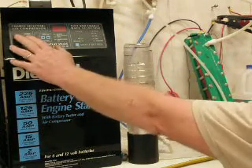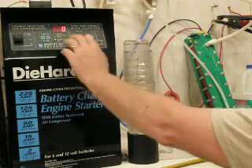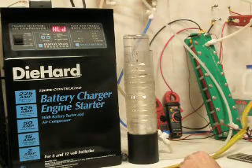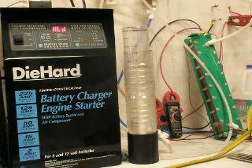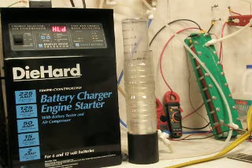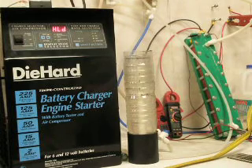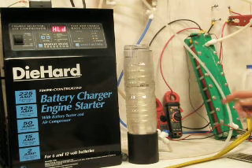Now what I'd like to do is try to match that 12.2 volts. Remember, we're at 5.9 amps. I'm going to disconnect the battery. It's got 12.2 volts. We are now drawing — I'll let it settle down for just a second — 11.7 amps. We're at 12.1 amps now at 12.4 volts. It's still fairly close. As you can see, this is a much better performance.